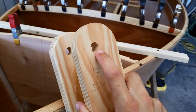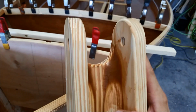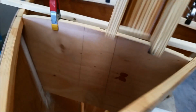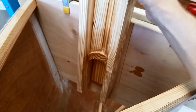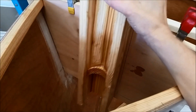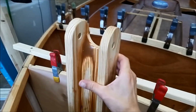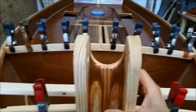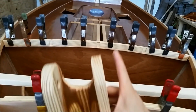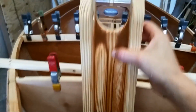Before I install the tabernacle, I will fill these pivot holes with epoxy and bore those out using the drill press. But the tabernacle goes right there, and it will get glued to that bulkhead with a very slight angle, so that when the main mast drops, it misses the mizzen mast. And we'll get to that probably in the next video.